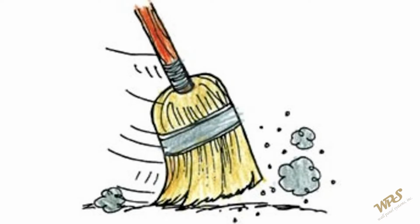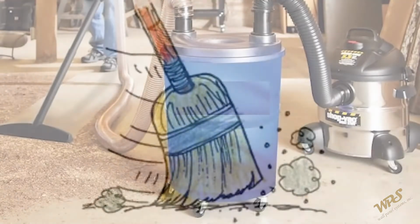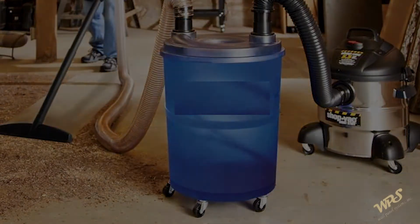When cleaning up dust and debris from cutting wood or phenolic material, never use a broom or brush if the debris material is dry. Sweeping dry material may send dust particles into the worker's breathing area. Instead, wet down the debris with a fine mist to suppress dust during sweeping or use a vacuum. Waste pieces of wood or phenolic material can be disposed of in normal waste containers.